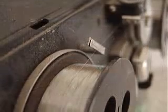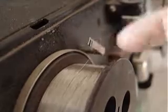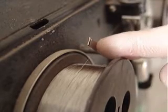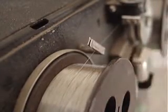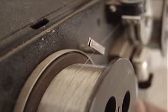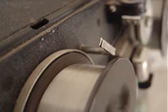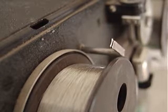One of the big problems of making a wire recorder is the fact that the spool's quite wide in comparison to the steel wire. These arms move up and down to make sure that the wire goes evenly on the reel, but the problem is that they do not always line up. So if I put this into play mode, you then get your wire breaking.